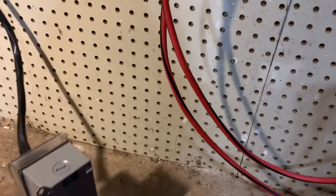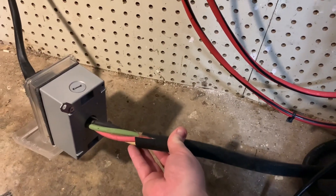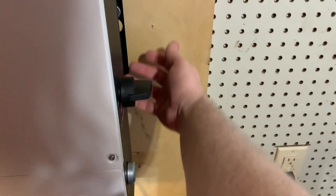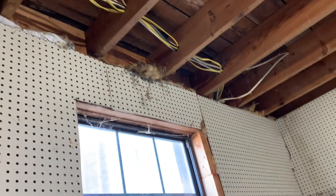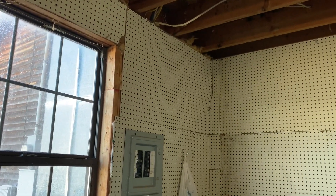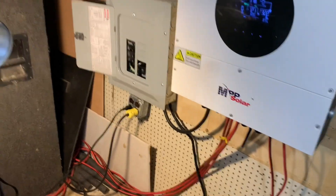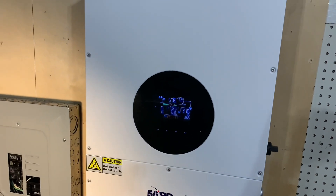That'll be coming as the budget allows. Same thing with this four-pin twist — this is proper cable that can be used as per code here, as long as it is mounted in an area where it can't be damaged or cut. I can run it along the side with cable support, go all the way up, pull that panel board right off the wall, and go directly into the panel box. That's how it's going to be done when I get around to it — it's all just being set up as I go, but it's safe and everything is good.